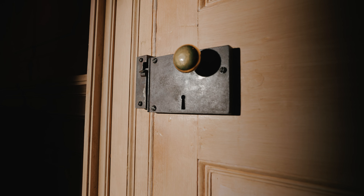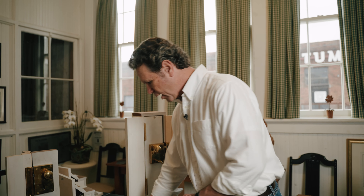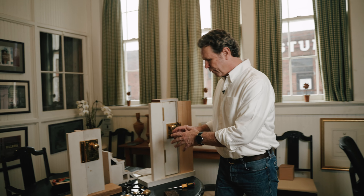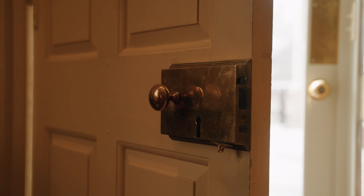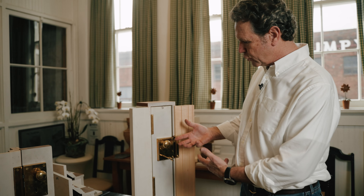Early box locks were iron like this - were iron locks. Later, they started to do brass. Sometimes you would see an iron lock with a brass handle, as the client could afford it, or a chrome one in this case. The only difference between the brass and the cast is just the covering on the outside. This becomes popular from the 1700s, 1800s into the 1920s and 1930s, as these were really popular in Colonial Revival houses. I love the rim lock because you get such a distinctive feature on the outside of the door.